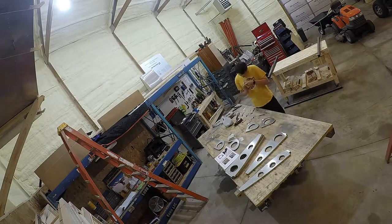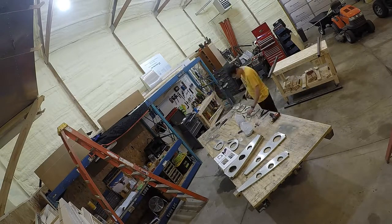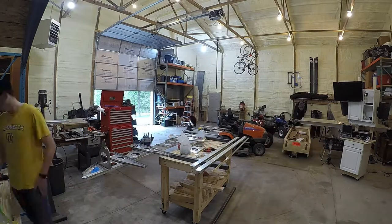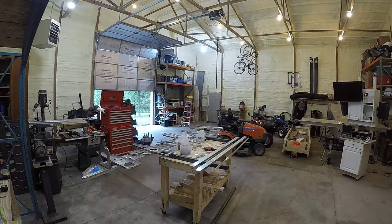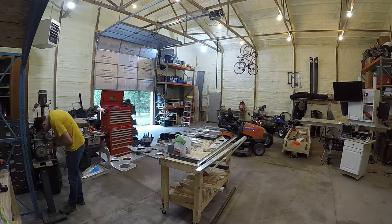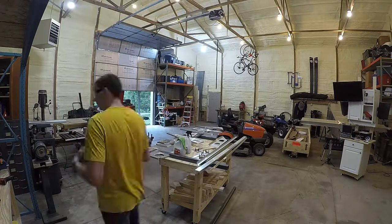Here I am assembling the other three nose ribs with the stiffener brackets with the leading edge slats attached. Now assembling the skeleton — went through and deburred everything before I assembled, which made life easier after the fact. Kind of learned that lesson on the first wing. You can see me going back and forth to the grinding wheel over there. I got scotch brite on that, deburring all the holes. I think everything was final size there, so it worked out pretty well.